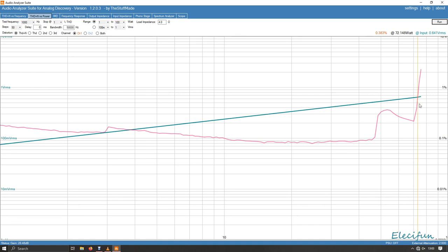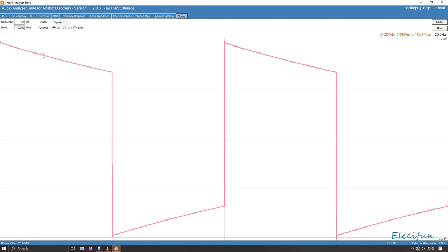That's not bad — I very much doubt it was pulling too much current. Remember this is running at plus/minus 32 volts rather than the recommended plus/minus 40 volts. Let's do a quick look at the scope — I'll go from low, middle to high. At 20Hz that looks pretty respectable; you'd expect a little bit of drop-off. This is an old circuit but it's pretty good when you consider it.